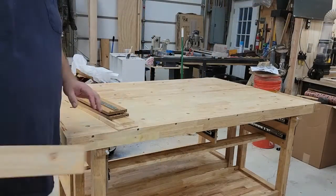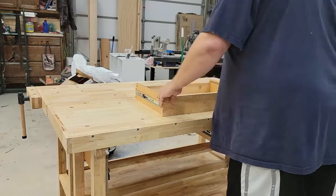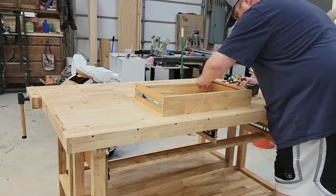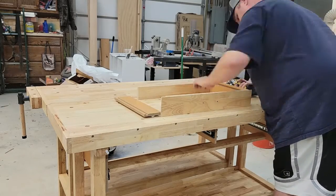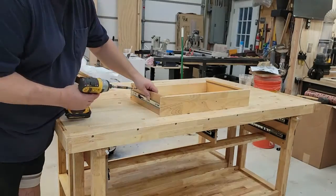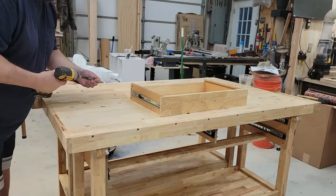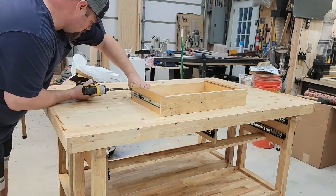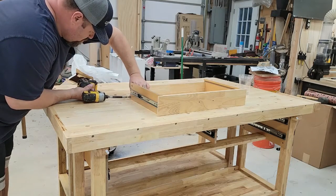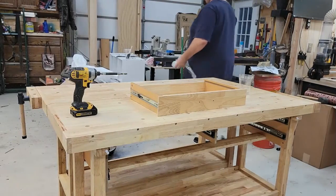Now it's time for drawer assembly. You'll need a panel 11, panel 12, a front, and a back. If you've assembled one drawer, you've assembled them all, but they have pre-drilled screw holes for you. Be sure that you align the drawer slides in the correct orientation and that the dados all line up for the bottoms to be slid in. The bottoms are wrapped up in visqueen.